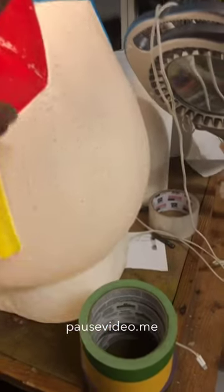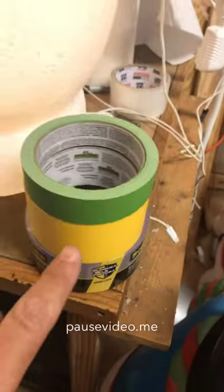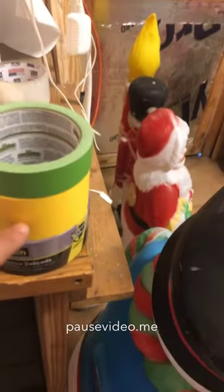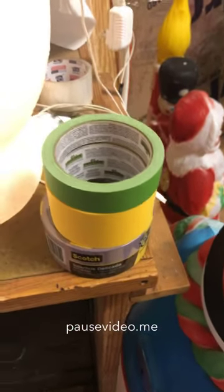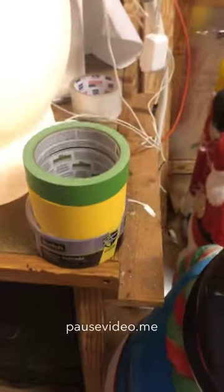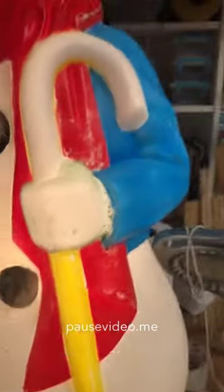The peeling happened because I used regular frog tape over areas I masked off. That's why I now use the delicate surface tape — the purple or the yellow. I prefer the yellow; I think it's made by the same people that make the green frog tape. It seems to stay on a little bit longer, and as you can see the paint is pretty even.